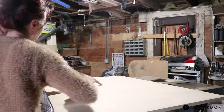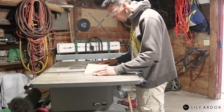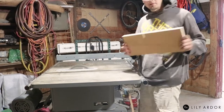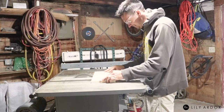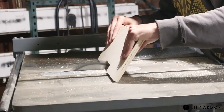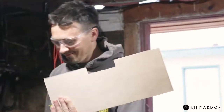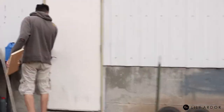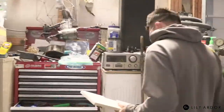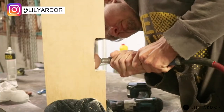To begin, we used our table saw to cut all our pieces out. I'll add a link in the description if you need the list of supplies and plans for this nightstand. Once we were done cutting out all our pieces, we decided to have a cutout for the handle instead of a knob on the front drawer. Since we didn't have a router, he attempted to cut it out with the table saw — I probably wouldn't let him do this again, don't try this at home. I was literally cringing the whole time, I tried to stop him, and I was totally surprised it worked. Following that, we used a metal grinder bit and an angle grinder to soften off the edges and straighten out the shape of the cutout.